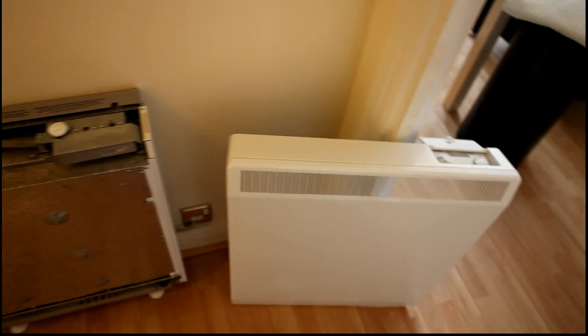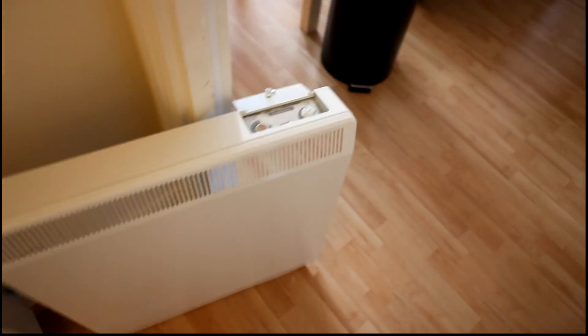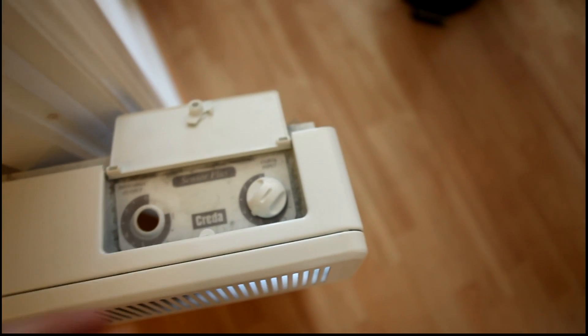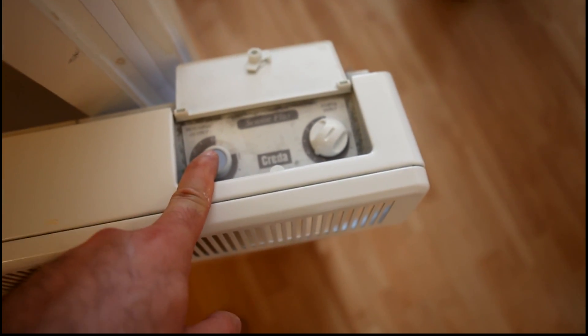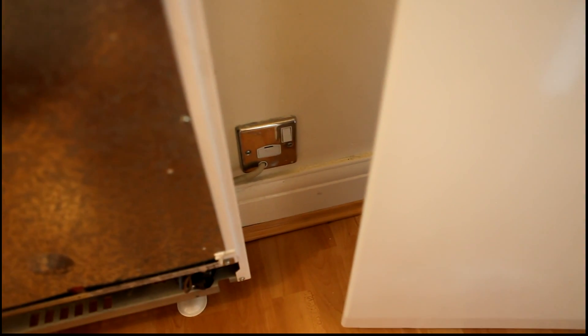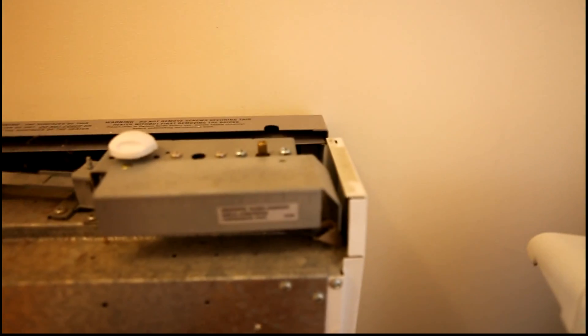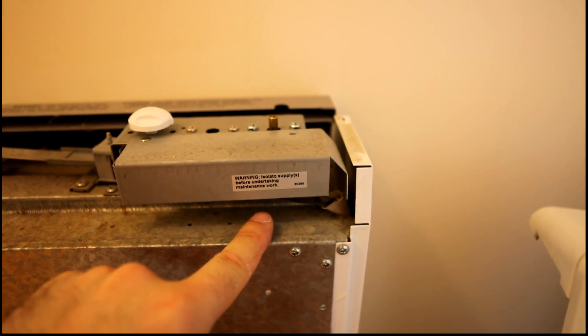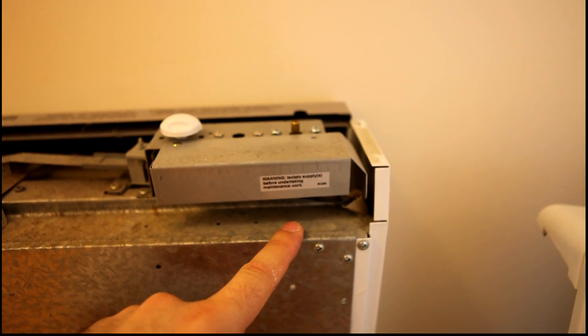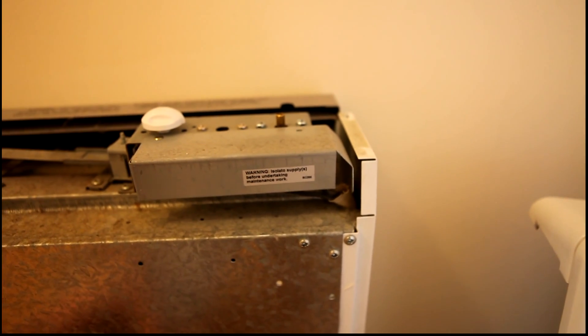OK, so this is the little brother to the heater we saw earlier. I've already taken the front cover off to save time. This one has slightly different controls - an input control and an output control. This is an electromechanical control panel, unlike the digital heater. This one has a single switch supply so it is only energised seven hours a day. The power comes through to this bimetallic thermostat, which measures the temperature of the top of the bricks and turns off the storage heater when they reach the temperature set on the dial.